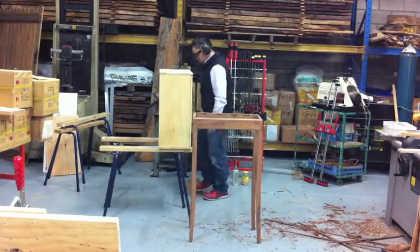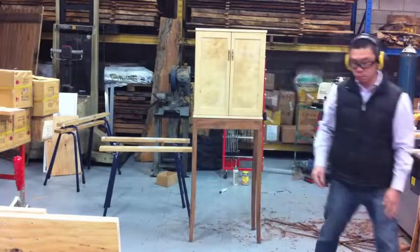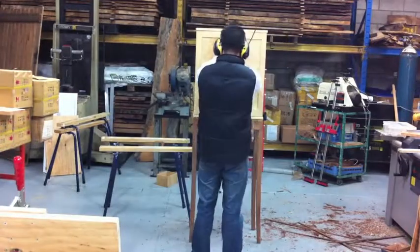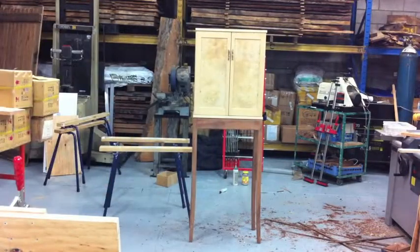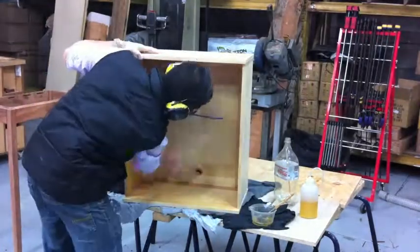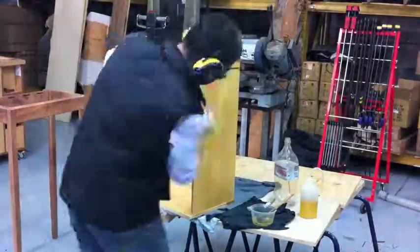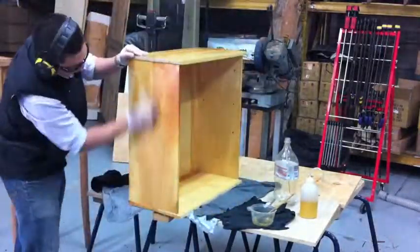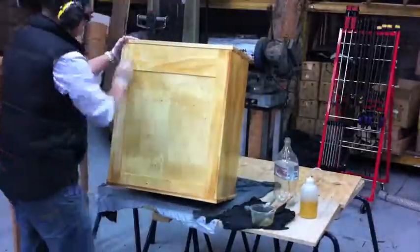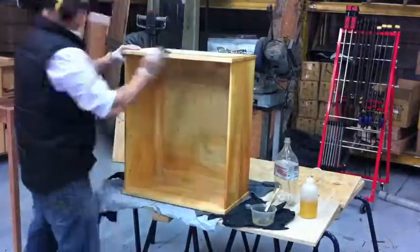The cabinet is nearly finished. I'm putting the top of the cabinet onto the base carefully — hopefully I don't drop it this time. The last step is to oil the cabinet. I use Organ Oil Danish Oil. I basically sand everything to 800 grit for this cabinet, starting off with 80, then 120, 180, 240, 360, 400, and then 800 grit.